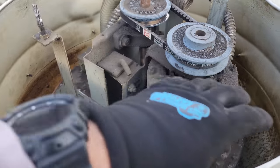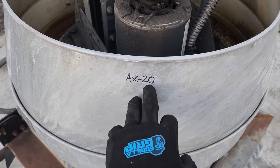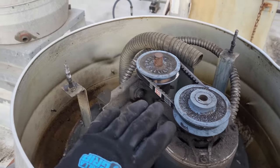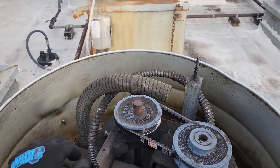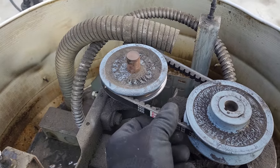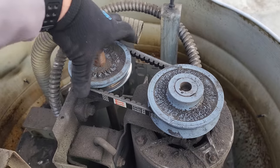What I typically do when doing something like this is go around and write the belt size with a sharpie marker — it'll disappear shortly, but I just write the size. That way I can put the lid back on if needed and take a belt count when I'm done. This is not a brand new belt — it's got some weird wear patterns on it, but it'll be fine for now.